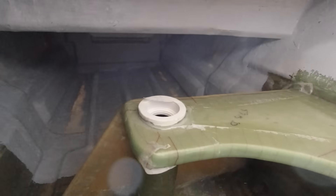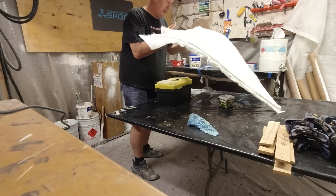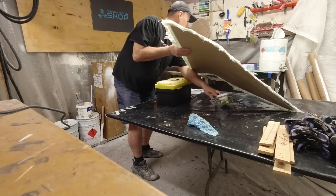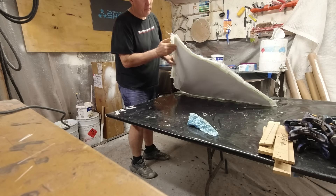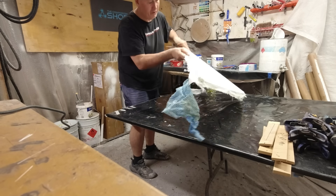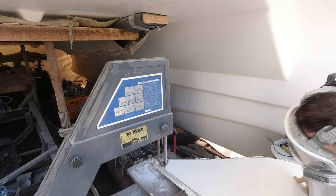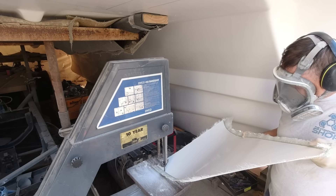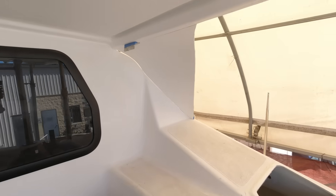Last week we fabricated a weather cowling for the cabin hardtop. This is a two-piece part that had gel coat on each side — now that it's out of the mould it can be trimmed and fitted to the boat. It's simple to make those parts in reality, but the challenge is integrating it into a part that looks like it belongs on the boat. The whole build has been an effort to make changes and blend the mods to make the boat our own — the time taken to make this happen can't be underestimated. It's a time-consuming part of the process, but to me it's the best part of the whole build.